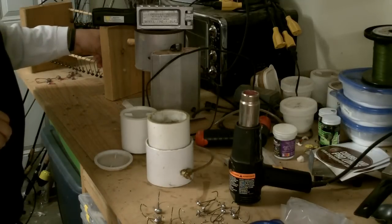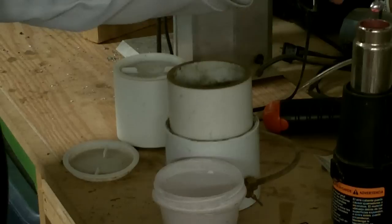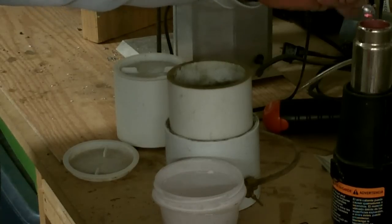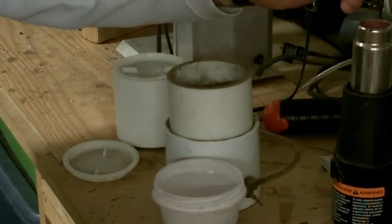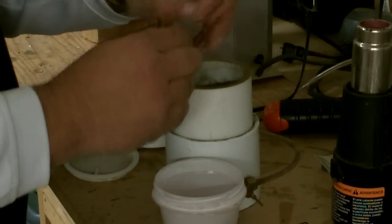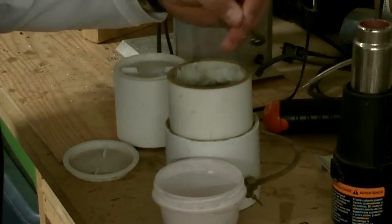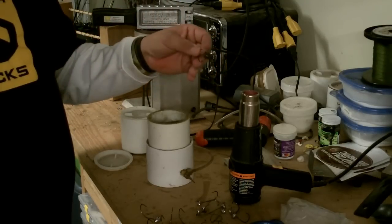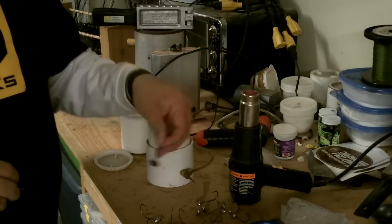Let's take a closer look now and do a two-step painting process. We heat the jig in the heat source — I've got the fluid bed with my base color, green pumpkin. That other cup has a glitter effect, which is basically a clear powder paint with glitter in it. When it's nice and hot, we put it in the first paint — if it looks shiny, it looks good. Swish it through like the bird in a birdbath, shake off the excess, then quickly dip it in the glitter effect. Because you've put two layers of paint on, you need to make sure you get that eyelet cleared out — it'll have a lot of paint in there. Now I've got a nice green pumpkin jig head with orange fleck in it — a color I use a lot. The key is always to get the least amount of paint on the jig, because when we bake it we don't want paint to drip and change the shape or give us an inconsistent look.